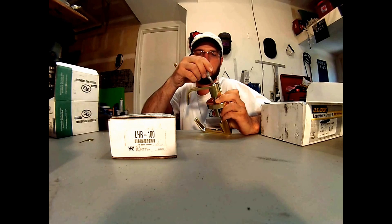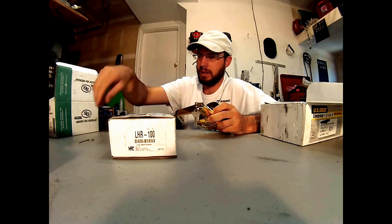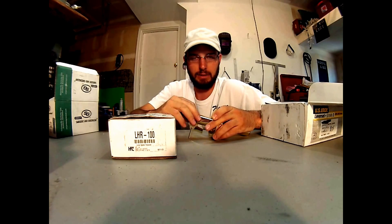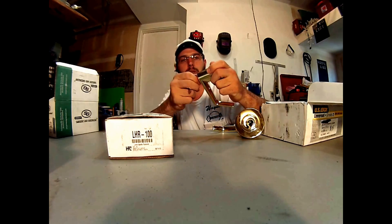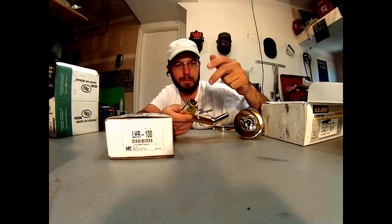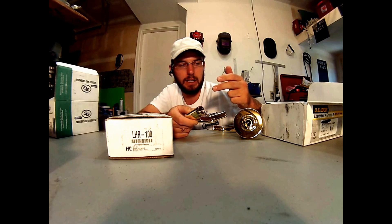If you don't have the key then you're kind of SOL. But the basic way that these lever locks work is if you have a working key — and only if you have a working key — you take this with your little key here, it goes in here, and then only when you turn it in the working position will the handle come off and allow you to re-key the lock. Basically now we can pull that out and go ahead and begin re-keying the cylinder, and at this point we'd be able to shim pick it or find some way to re-key it to whatever you want.